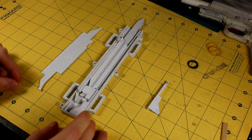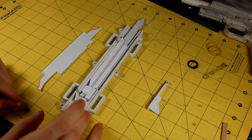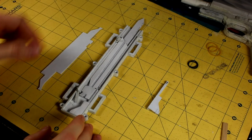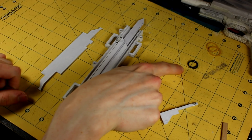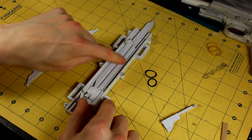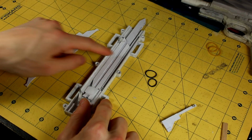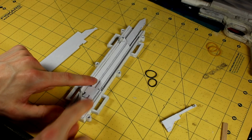So basically now I just have to make the top cover and a few other components that will make it work by pulling a string, so it'll be string activated. And I also have to get some new rubber bands because these don't work very well at all. They're just kind of wide, so they just rub on the sides in there. That's why I have to twist it up so it doesn't rub on the surface in there, because that causes additional friction, which prevents the sliding components from moving.